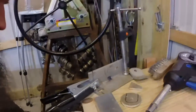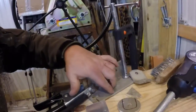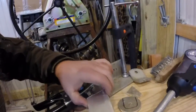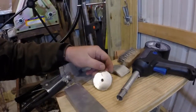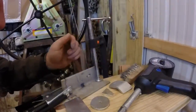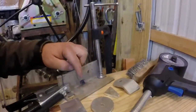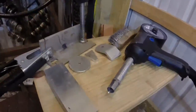As you can see here, we've got a few small pieces of aluminum. It's pretty easy to tell which ones are oxidized — which ones have a dirty coating on them and which ones are new. This side here is fairly clean, but that's actually a kind of dirty piece of aluminum to try to weld. We're going to try to weld it right off the bat and I'll show you what it looks like trying to weld into a highly oxidized piece.